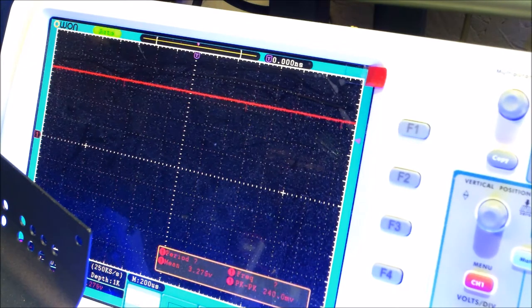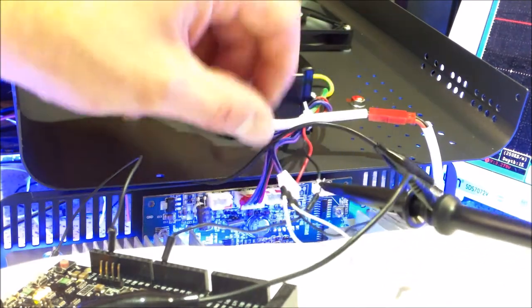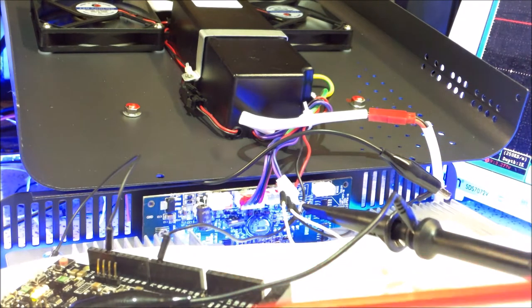If you've been following my videos, you know I made a zero-to-ten volt analog shield — I won't need that. All I'll need to control this is the Typhoon code with a 3.3 volt Arduino, and that's it. I won't need the factory board because I'm going to completely do away with that. I thought about leaving the board and having it come on and off and just use the Arduino with the PWM pin disconnected. The only issue with that is the Arduino clock and this clock are going to have to be exactly the same for timing.